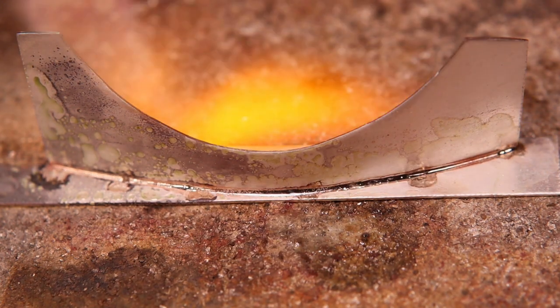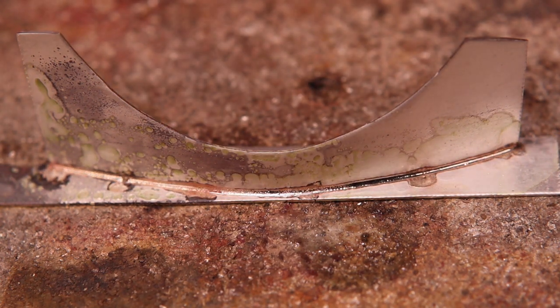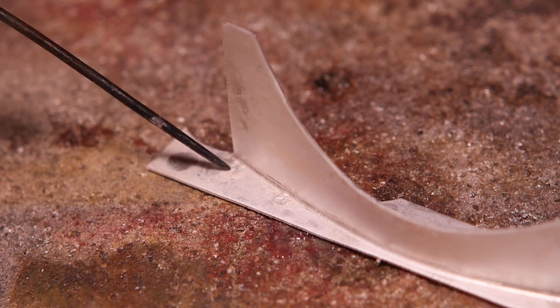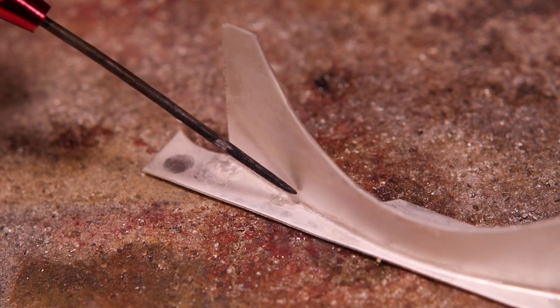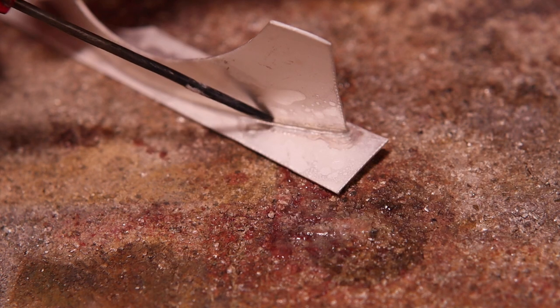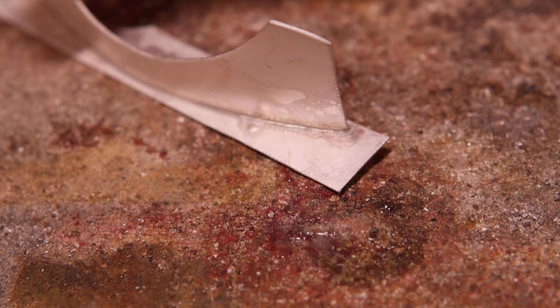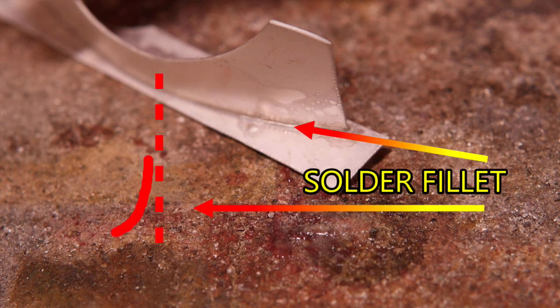The solder has flowed along the entire seam, making a large fillet or snowdrift effect. Let's take a look at the solder seam in more detail. Notice where the pallions were placed is a residue of solder. These are quite rough and will definitely take some effort to smooth them out, especially because there are 6 spots along the seam. Also, look at the large fillet along the seam, making the seam not sharp, crisp, or square.